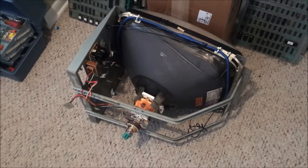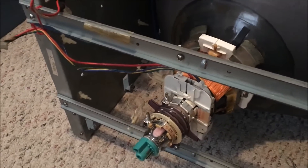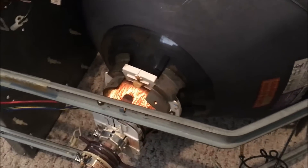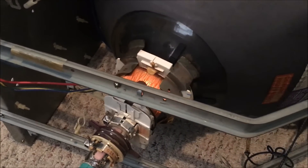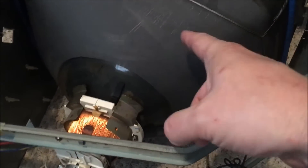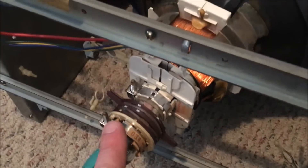This is the Nintendo 20EZV Sanyo monitor tube and frame that I just got done washing. How I did that is I sprayed it really good with Simple Green all over, then scrubbed around with a toothbrush. Do not scrub the black coating on the monitor tube itself — just spray it and let the dirt run down. I took a gallon jug of water and poured it over to rinse. Then I sprayed the frame with Simple Green, rinsed it, and that was good enough to get all the dirt off.